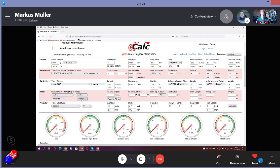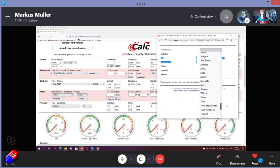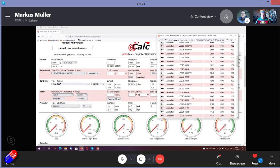So here is a search. We can search for this. I reduced the search to one manufacturer so that the list is not too overwhelming. So what we want is a motor that can absorb at least 600 watt and is between, let's say, 130 and 180 grams. We do the search, then we have here a list